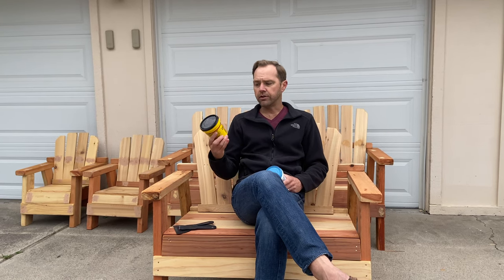Sometimes — and we've done this in some of our videos before — you can take real rough cut lumber, spend a decent amount of time on the back end filling the wood, sanding it down really well, and then doing a nice stain job. You can take this relatively cheap lumber and make it look pretty good. We'll include a link to some videos we've done before that showcase that. When it comes to applying wood filler, our two favorites are the Minwax stainable wood filler and the Famowood stainable wood filler. We've done a review comparing them, but they're both great.